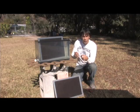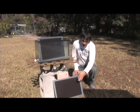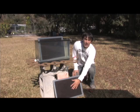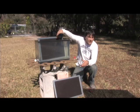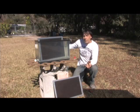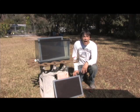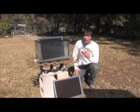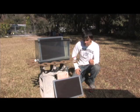You still get a good voltage. You actually get something a little amazing. This panel right here is about 136–137 degrees Fahrenheit, while this one is cool to the touch because it's in cool water — it's about 70 degrees out right now. One thing a lot of people don't realize about photovoltaic solar panels is the cooler they are, the better they operate. If you're in a cool climate with crystal clear sunlight, you're going to get a better voltage than if you're in Florida when it's really hot in the summertime.